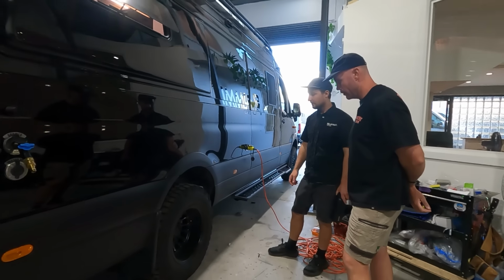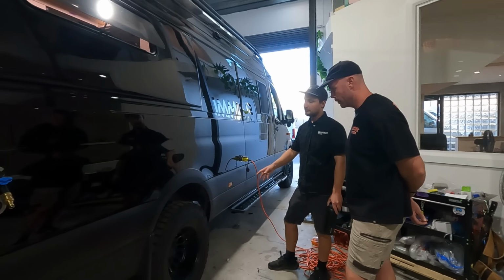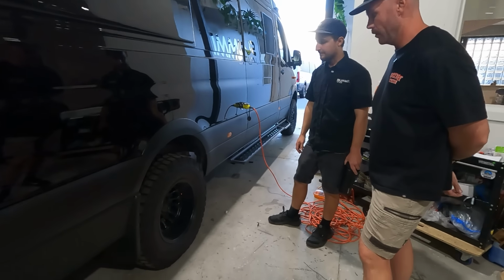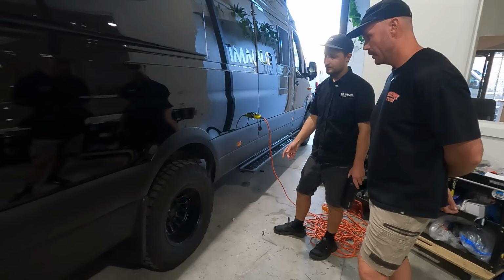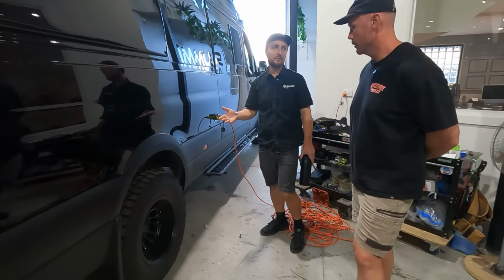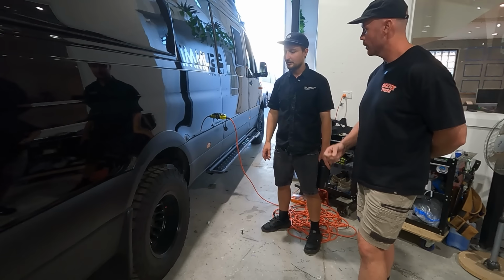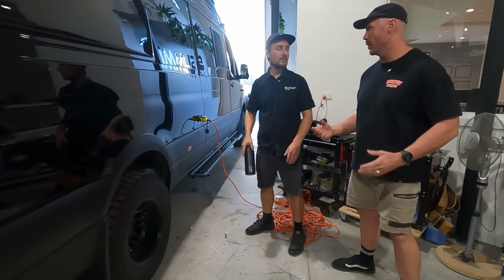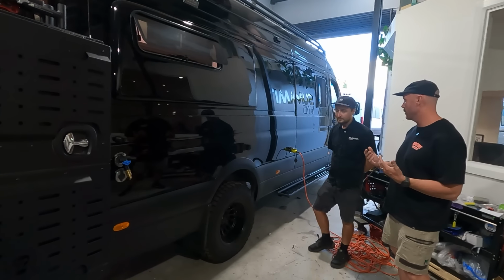Yep. And working with Riker, essentially it means you do not need to run 7 tyres. You've got 5, including your spare. And also off-road, when airing down, you can bag out a bit more. For sure, yeah. Get that wider footprint. We've done a few dualies where we've done all terrains, and you literally can't fit a piece of paper between the tyres even at full pressure, right? So when you're dropping those down, you're obviously going to be contacting. So yeah, I feel like that's a huge oversight for when people have bought 5 Series vans with the dual wheel. It's something they haven't even really thought about, or maybe not even known about.